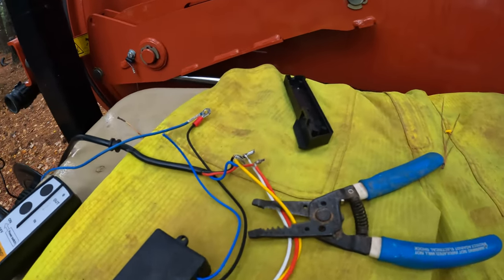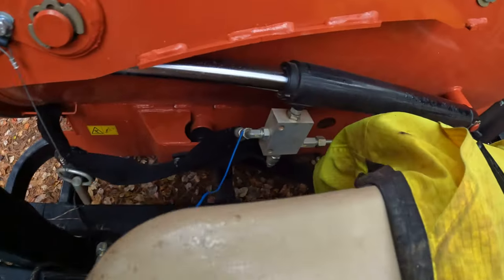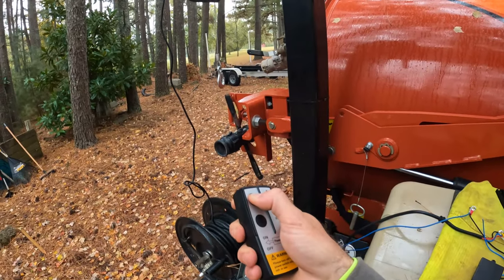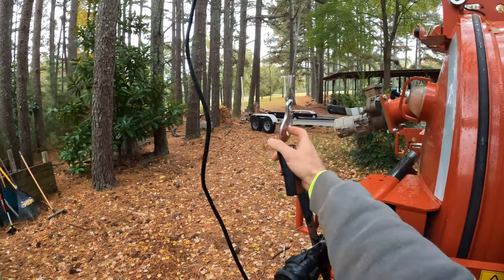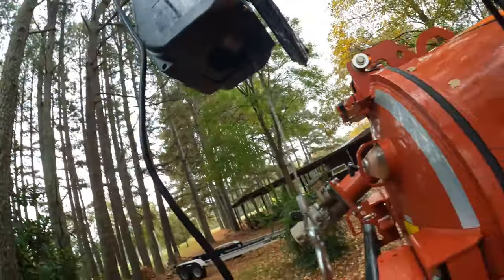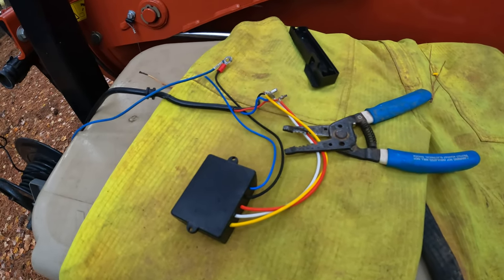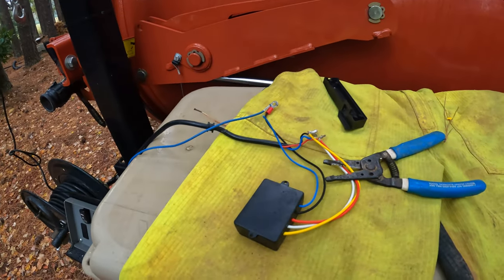About 10 or 15 minutes later, I've got these wires stripped with some very rough connections going on so I can figure out what's what. Ground running over to the hydraulic split block, believe it or not. We've got our wireless remote and we've got our winch. The out function really doesn't like to work unless there's some weight pulling down on it — got to be careful with how that wire's spooling up on the inside. Just 15 minutes connecting a few wires. With 12-volt DC you're never going to hurt yourself playing around with this stuff — just be careful and use your common sense. Now that I've got a general idea of how this works, I'm going to mount this little box up on the boom and finalize all these connections.